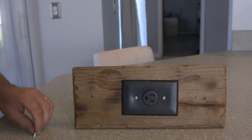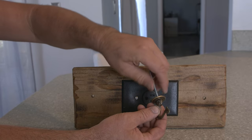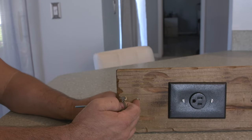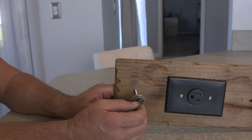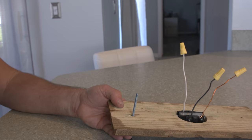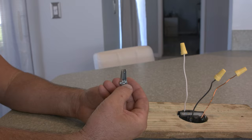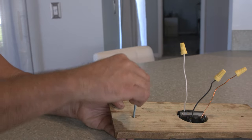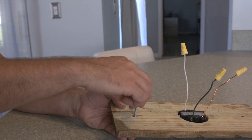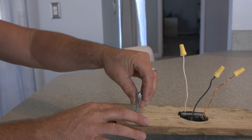For the most part you won't hit a stud, so what you do is screw this bolt into the decorative swag hook and get it nice and tight. Then there are pre-drilled holes — push it through the hole. On the other side, take this butterfly toggle with its little nut and turn it on a little ways, not too much — leave room for the drywall that's in your ceiling.